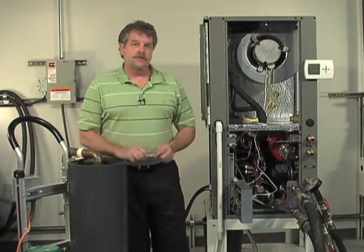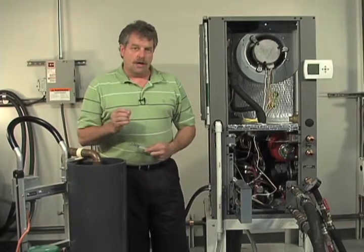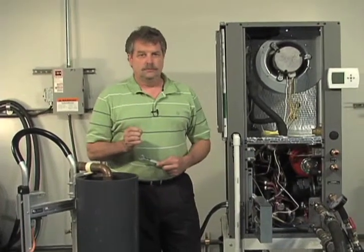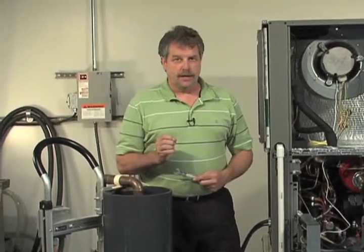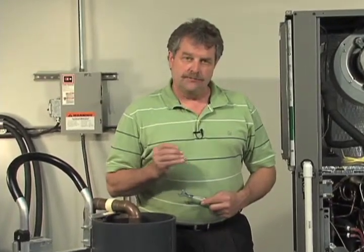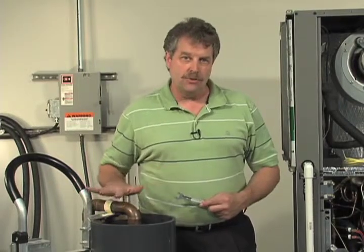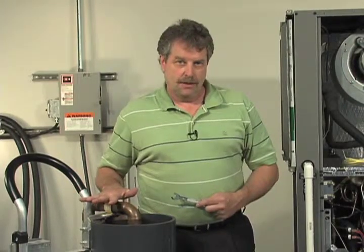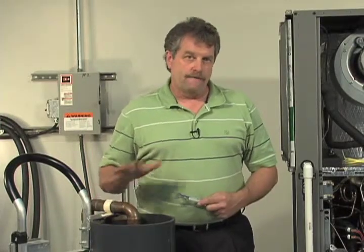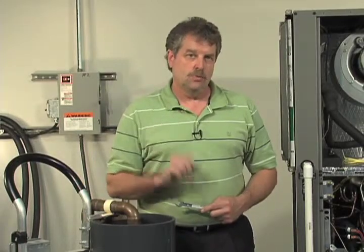Guys, I can't emphasize enough: be patient. Go through all the steps to verify you have successfully removed all the air. No one wants to come back and try and explain to the homeowner why they're back doing it again, especially if you kind of rush through this. This doesn't have anything to do with how much time you spent. It has everything to do with verifying you removed all the air from the loop and from your heat exchanger. So again, guys, do it right, do it once, do it well.